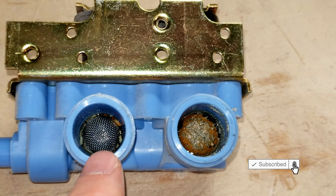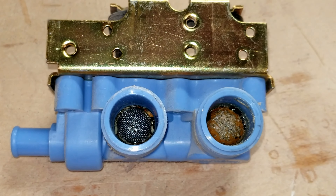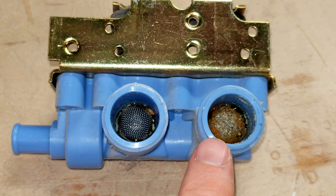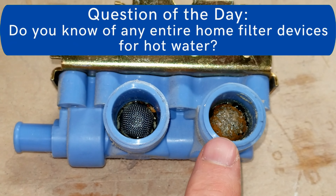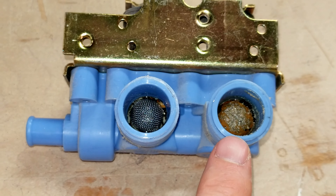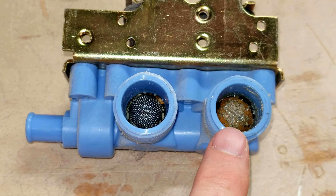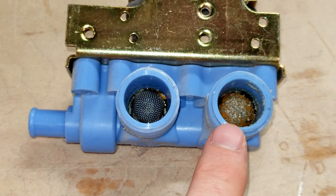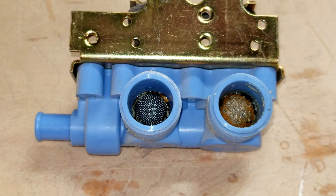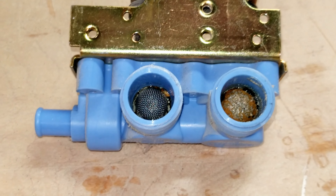The bigger problem was the cold water wasn't closing all the way, so it was dripping. If anyone knows a way to catch all the sediment on the hot water side before it goes into kitchen sinks, faucets, washers, dryers, or any appliances, let me know. This is a frequent thing I have to deal with on my washer and dishwasher — taking the supply off, cleaning the screen out. If you know any way to filter that stuff out before it gets to the appliances, comment below.